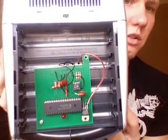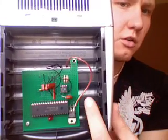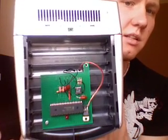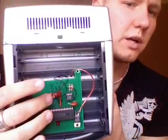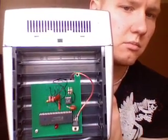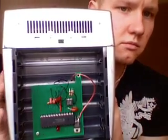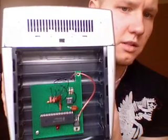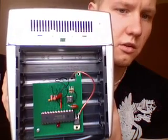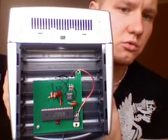It's just usual COM port signals. The big microcontroller has nothing to do with the graphics — it just sends the text to the small microcontroller, and the small microcontroller handles all the PAL signal. So it's fairly easy to do some new graphics. You don't have to modify the whole graphical method — you just have to change the RS-232 signals.